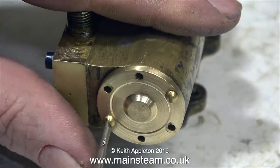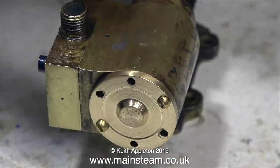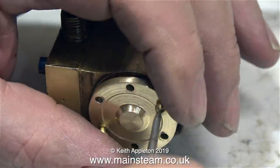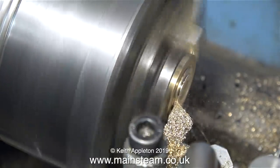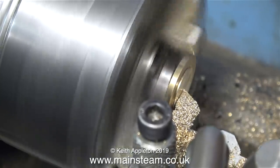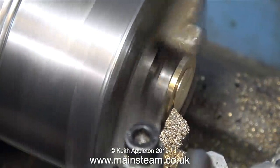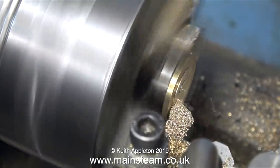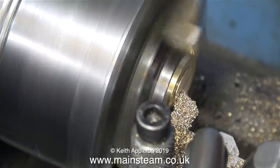This time I'm fitting the cylinder cover — well, temporarily anyway. If you remember, when I made the cylinder cover the register is a little bit deep and goes too far down into the cylinder, so I now have to correct this. The reason for leaving the register quite deep in the first place was so I could hold it in the chuck to turn the fancy front of the cylinder cover. I've accurately positioned the cylinder cover in the chuck by pressing it into place with the tailstock chuck, and I'm currently machining away about 50% of the cylinder cover's register. I'm not removing too much because this will need a gasket — a very thin one. I need the register to locate the cylinder cover on the cylinder itself.